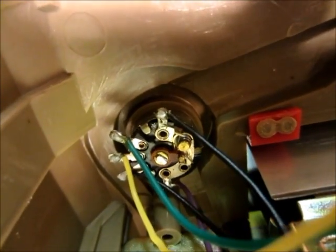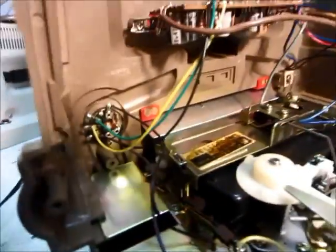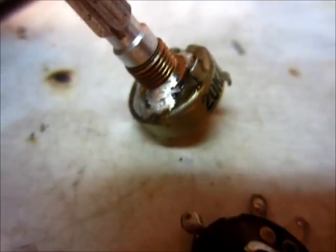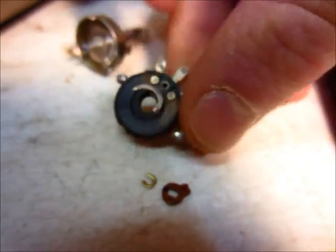There's this little volume control wheel. It's just the kind that has a little switch on it — a somewhat common part. I don't believe I have any of those. I tested the resistance and it seems to be all over the place, and it's also quite loose. The nut doesn't move, but the whole housing part probably got smashed or something. So I fixed this — I soldered the bearing back on there because the crimps had come undone. The resistive coating looks just fine.